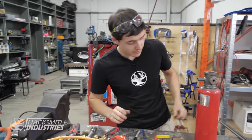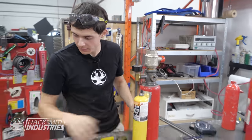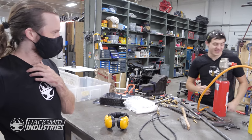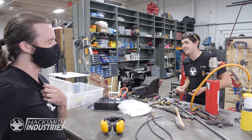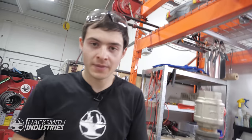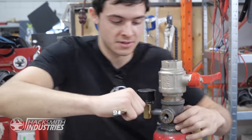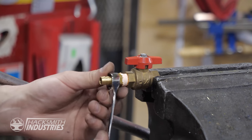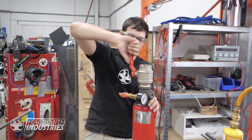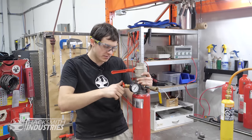We should have just about everything we need. I also got a pressure gauge that goes up to 160 PSI. We need to hook that up, along with this hose. With all three valves closed, we should be able to pressurize the system and have it not explode. We're going to pressurize through the outlet up to about 120–140 PSI, which should be more than enough, and then make sure there are no leaks.